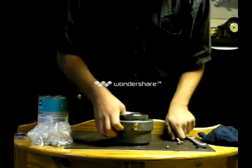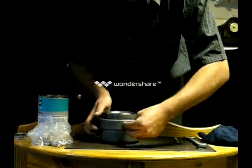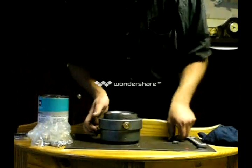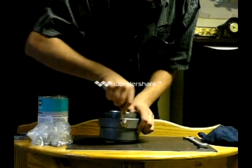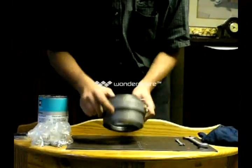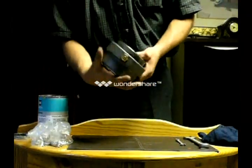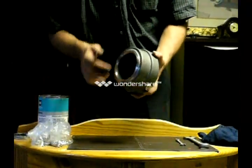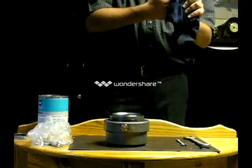After that application, you will go to the other side of your swivel. You will put your grease nipple on that end. Use a ring spanner and tighten. That's the complete, installed, put-together liquid swivel. You will put your grease nipple on the little one. That's it.